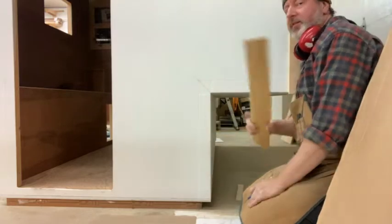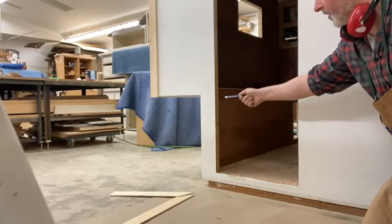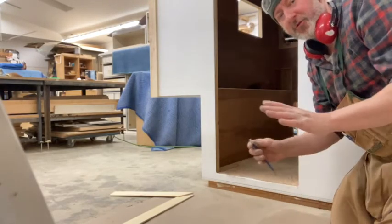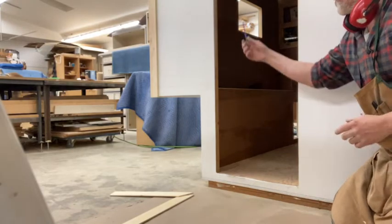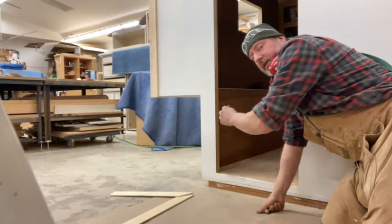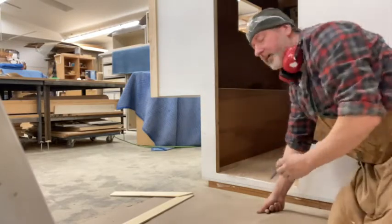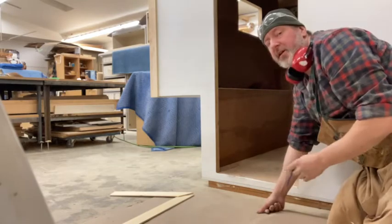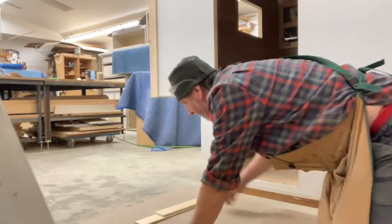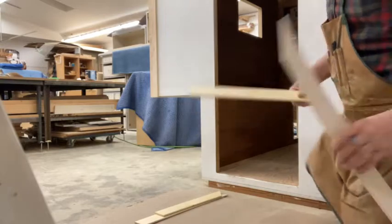Okay, so now I can trim off the square ends on the other side here, because my door frame, I'm not sure how far it's going to come over, so I'm going to cut these pieces. I'm not going to attach them in, I'll leave them till later, till I figure this all out, because they're probably going to need to be trimmed down a little bit narrower on this vertical part anyway. So these we can fit and cut.